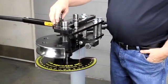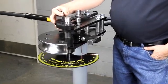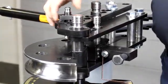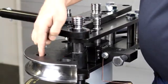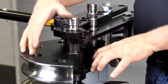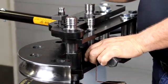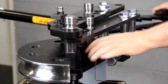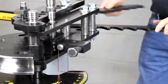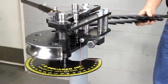Some of the features on the bender: if you notice right here, you see the top of a pin. There's a ramp machined in the bottom of it that once we engage it, it'll track through these holes — ramps are machined into these also — and as the die rotates and gets over a hole, it'll essentially lock the die up. That prevents it from springing back. We also use a secondary anti-spring back system, which is just a two-ratchet mechanism. The first ratchet does the bending; the second ratchet is the actual anti-spring back.